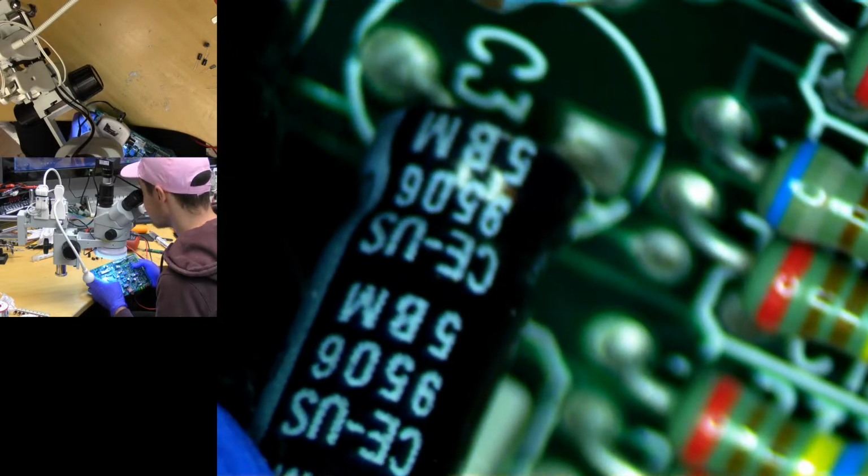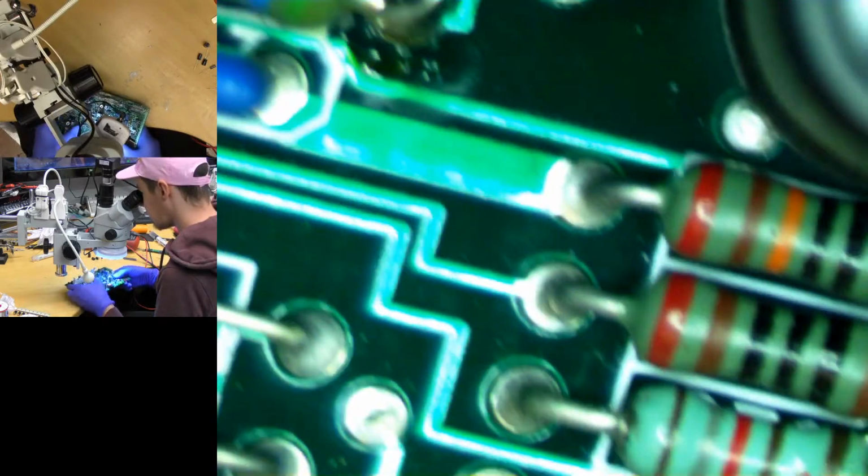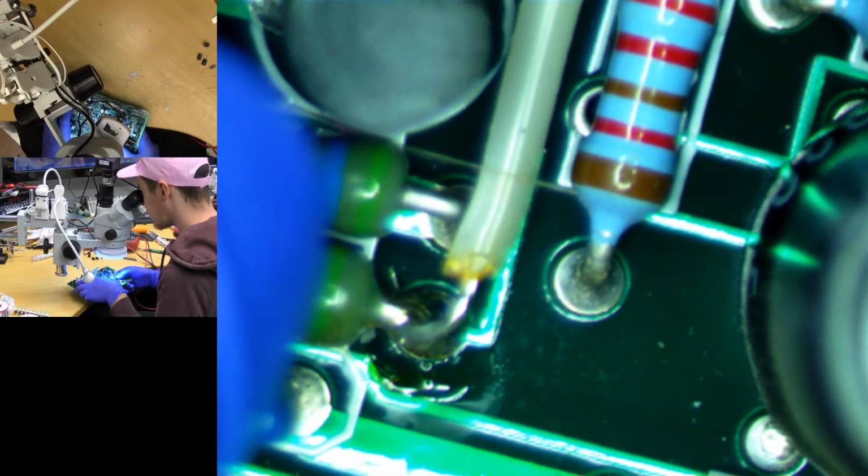So we might have some corrosion issues, usually around the mark on capacitors. There's another big one. That one looks fine. This one also looks fine. And I mean fine as in hasn't spewed all its contents out over the board as these guys have. There's another one over here. That's looking good enough. Original factory bodge work here. Grey wire going over there. No problems with that at all. Oh, there's one cap I forgot to grab out of a box. A 135, but I should have a few of those.